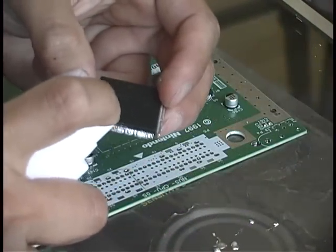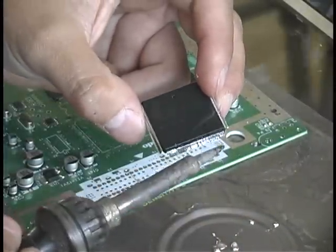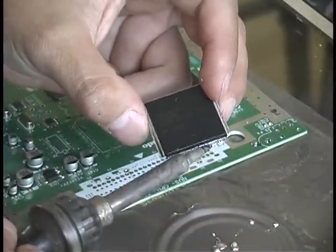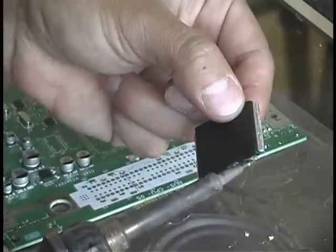To clean off the pins of your chips, I recommend applying some flux to them and then taking your soldering iron and just slightly rubbing away from the chip — all of the excess material will collect on the tip of the soldering iron.